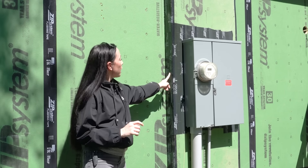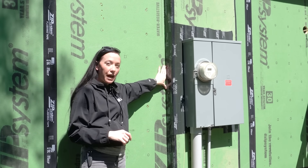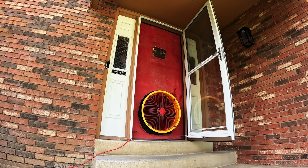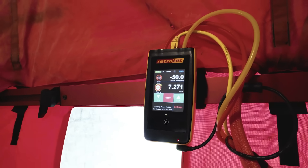We're going to add one more piece of flashing tape around the sides and top to protect the gap between the two walls. This is coming along really nicely. We blower door tested this house before we started — it was a pretty leaky home — so I'm excited to see how tight it turns out when we're done. We also decided to add an ERV to the brand new HVAC system, which will be really great.